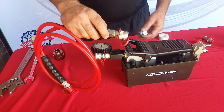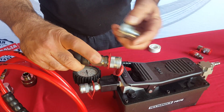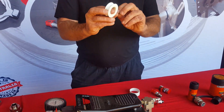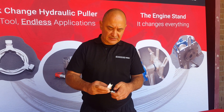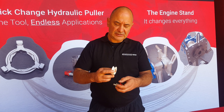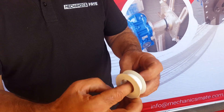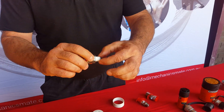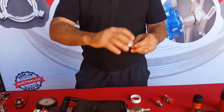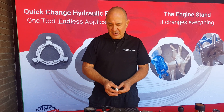On the other side, the hose will not come with this fitting — we need to put that on. It will come with that male fitting. What you do is you unscrew that off and then you put the female fitting on. Before you do any of that, you want to get some thread tape and make sure that you put it onto your fittings first. Think about the direction that these go on — these are all a standard thread, NPT, and they screw in clockwise. So when you run your tape on there, you'll always run it around like that, three or four times, then break it off. When we go to screw this in, it'll wind the tape in the same direction which we laid it on, so it won't peel off. If you wind it on the other way, it'll try and peel the tape off. So with all your male threads, put some thread tape on there first — about three or four wraps and you're ready to go.